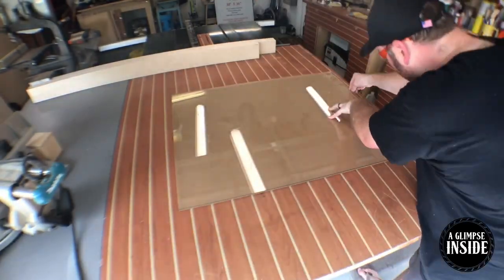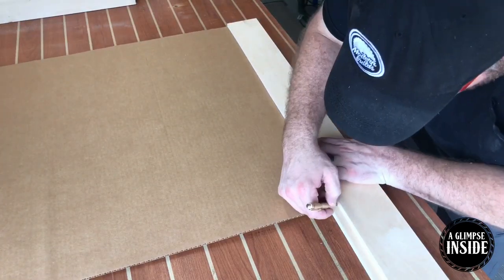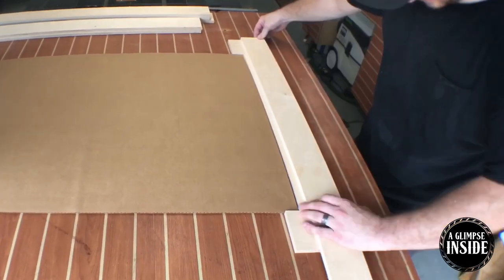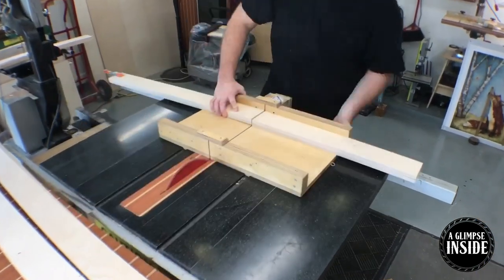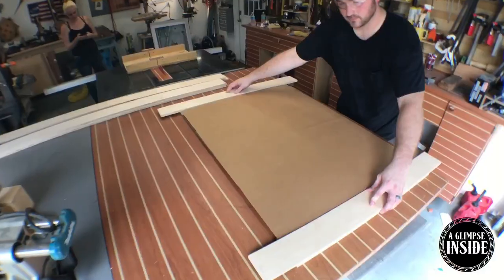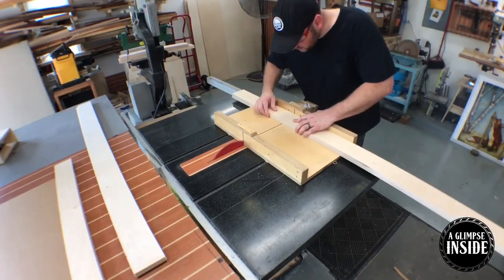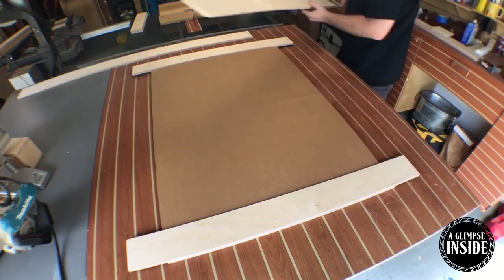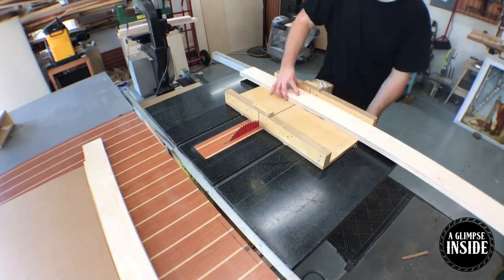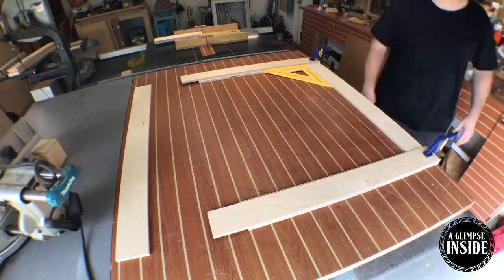Now, essentially I'm going to build this frame around this piece of glass, but instead of handling the glass over and over again, I've cut this cardboard template. The three and a half inch piece is the back of the frame; the four inch piece is the front or the face of the frame. I'm cutting these pieces in reference to how big that template is. I'm making essentially a rabbet out of layering a piece on top of another piece with a half-inch difference. This is going to be where the picture rests. Each piece is layered such that at each of the corners it forms a half-lap joint.